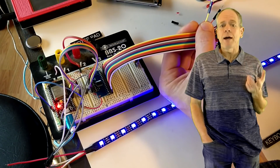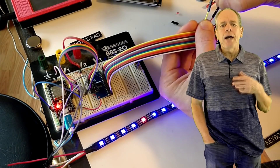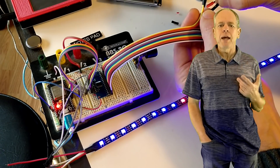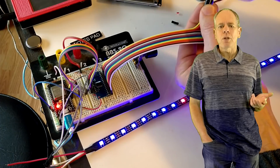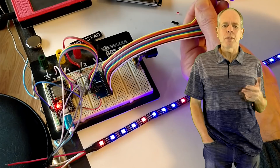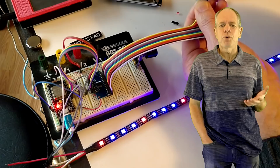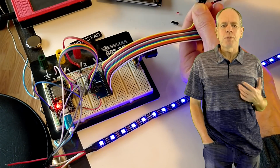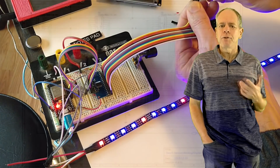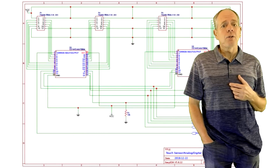You can find the modified library along with the test sketches on my GitHub page. I then prototyped the touch input system using an LED strip and selected a touch threshold value of 11. I was able to touch the end of a wire and the corresponding LED would change from blue to red, indicating the touch. I tested it for touch inputs 13, 12, 14 and 27, which are the inputs to be used in the yellow box. I added some software filtering to eliminate any false positives and got rid of all flickering. Overall, this looked very promising.